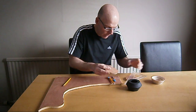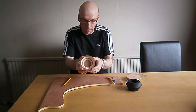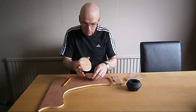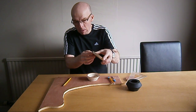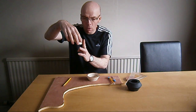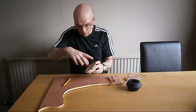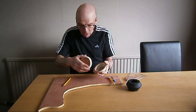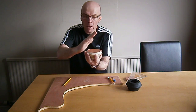So, as it starts coming out, you're left with this. Now, when you're cutting at 30 degrees to cut this shape — that's cutting below the scroll saw. If you cut above the scroll saw, it will cut the other way. So, you would draw around that base piece, cut that out above the scroll saw, and it gives you a piece going in.